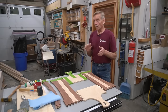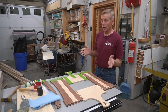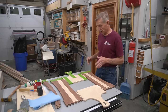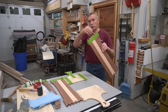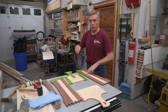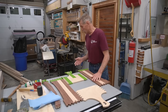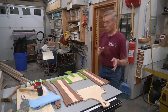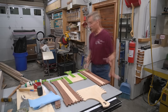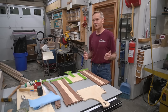So I'm going to double check the camera before I head into this, because once I start gluing this, I can't stop. I do have the furnace shut off because I don't want any hot air blowing on here, because I've got to butter up all the joints, the fingers here, here, here, here, plus the end of the tenon, get all that done, slip together and clamps on it before the glue skins over. So it can be a little bit messy, but if anything goes sideways during the operation, I've got to just keep going and I can't stop to deal with the camera. But now that I've done everything I can to make the glue up go smoothly, let's do this.